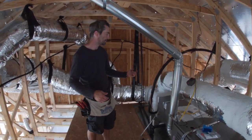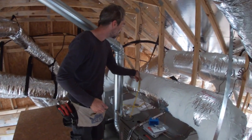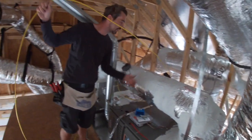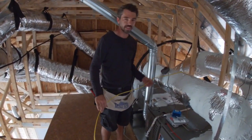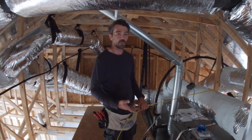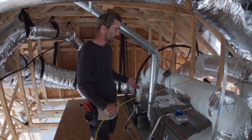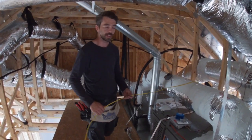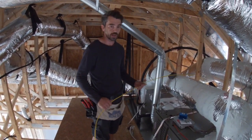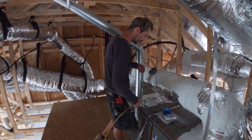Fortunately for us, the gas is done and HVAC is done, so I'm going to show you how to hook up the gas furnace all the way. I've already ran my 12-2 from the panel up here and threw up some extra because I'm going to need a little bit. I'm not putting a big 60-amp disconnect for this — this one has a cheaper way of doing it. If this was an electric one we'd have to do one of the pull-tab disconnects, but this one doesn't need much power. All we're doing is giving power for the igniter light for the gas. I'm just used to running 12-2 to these gas furnaces, which is just a regular 20-amp breaker in the panel. This thing doesn't need much power at all — it's all gas pretty much.